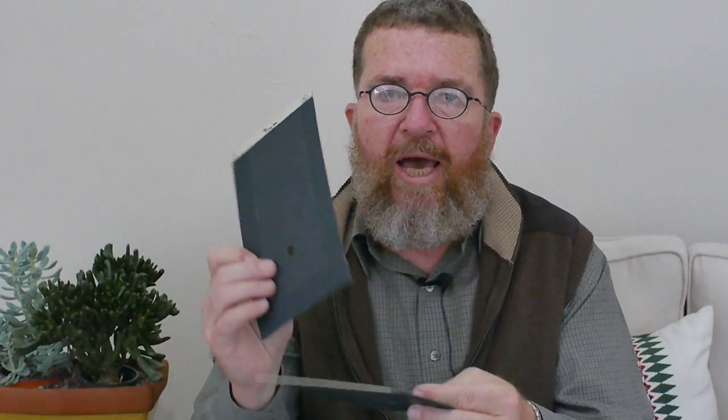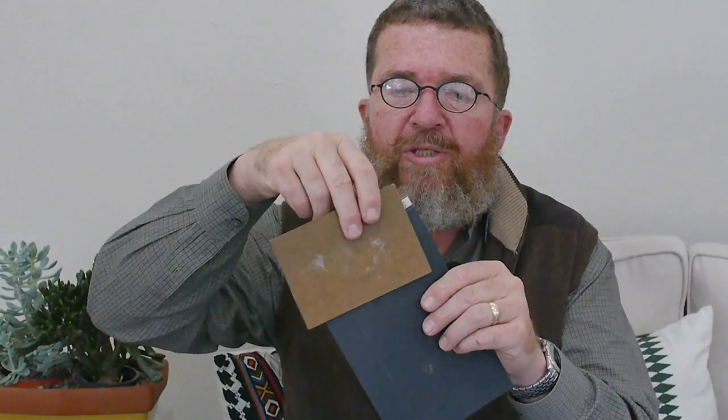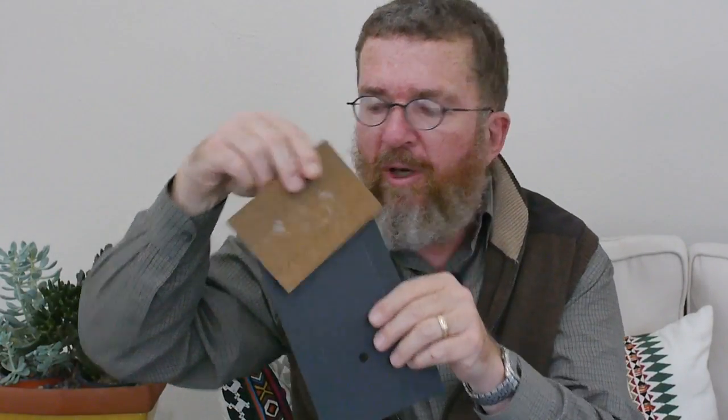To have all those aperture stops I expanded on the system I'd been using. Originally the aperture plates were made of Masonite board — I had a 34mm one and a 17mm one. I also had a 3mm one made from brass set in Masonite. Later I made several from heavy black craft paper with edges reinforced with black gaffer's tape, using a Masonite spacer in the slot to prevent light leaks.